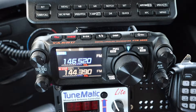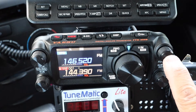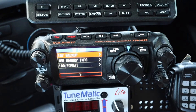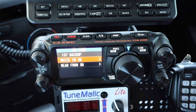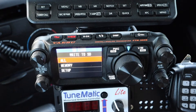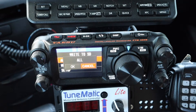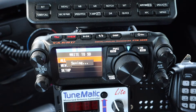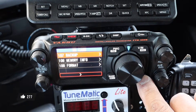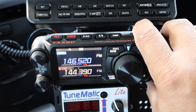We are here in the mobile. Turn on your radio, push and hold Function, go to Setup Menu, select SD Card, select Menu 107 Backup, Write to SD. Make sure you have an SD card inserted. Select All and move forward to OK, then select OK. It's going to save your memory and your setup both, and once completed you can back out.